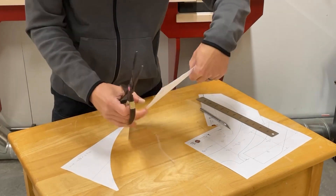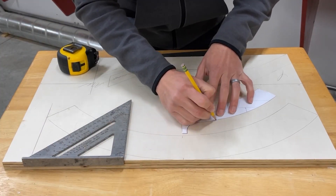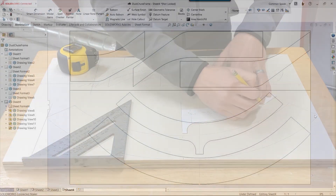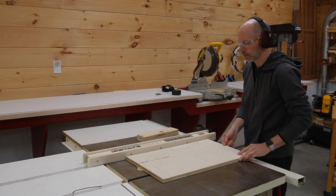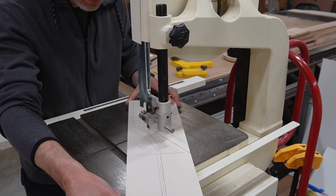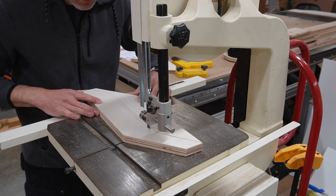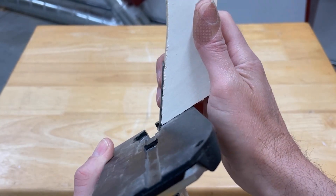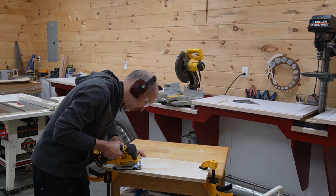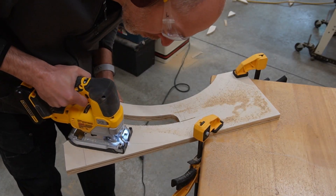I use a sharp blade and a pair of scissors to cut out the pieces, and then transfer them to a piece of 3/4 inch plywood. Being able to first lay out the parts digitally gives me a ton of confidence that they'll all fit on this scrap piece. I cut the plywood into two smaller pieces to make it easier to manage, and then cut out several parts at the bandsaw, just taking my time and carefully following the lines. The uppermost piece of the frame calls for a bevel, so I tilt the shoe on my jigsaw and use the frame's side wall to set the exact angle. With the piece firmly clamped to a work table, I cut the beveled curve, and then move the blade back to a 90 degree position to make the rest of the cuts.